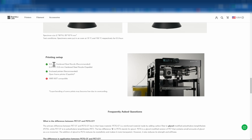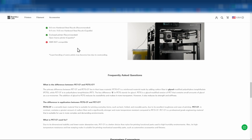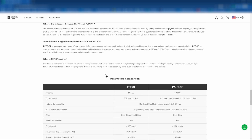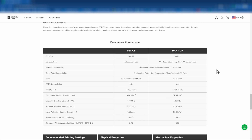On to printing setup: a 0.6 hardened steel nozzle is recommended, which is what I have loaded. These are capable with a 0.4 nozzle though I haven't had great luck with it, and there's a 0.8 option I've never used. The product page recommends an enclosed printer, though it does say open frame printers are capable with a caveat. Generally these higher-temp filaments need that enclosure. I have an enclosure so I don't need to worry about it.